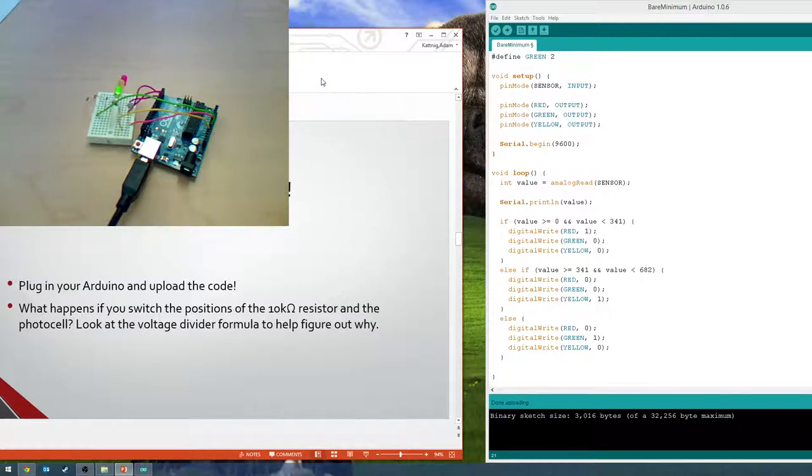Multiply this together, you're going to get 2.5, right? Check the serial monitor, see what you're doing. You're going to have current flowing through, and then you have voltage that's dropping. When you have a current here, and then another voltage dropping from here, you're comparing everything to 0 volts. We're just looking at the 2.5, the voltage drop between our 0 volts and the switch.